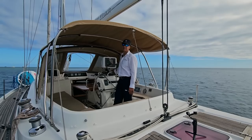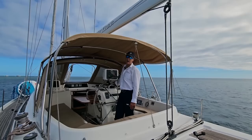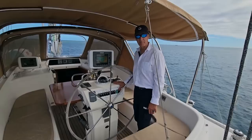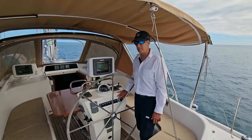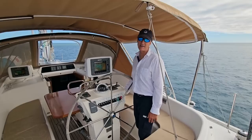We're going to start our tour of Oyster Reach in the cockpit. We'll begin with the engine controls and go to the sail controls and some of the other items in the cockpit for normal yacht operation. To start the engine, very simple on this yacht: simply turn on the run button. That starts the fuel pump. Once that noise goes off, we hit start and she's running.